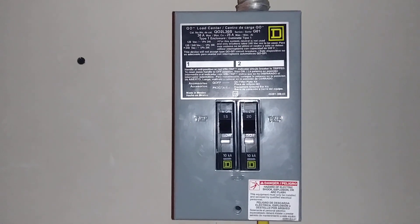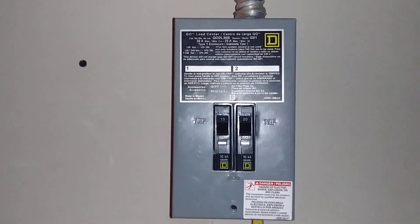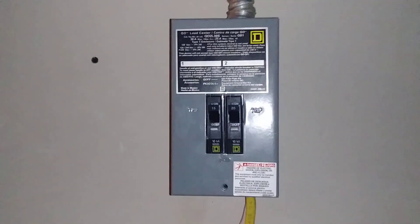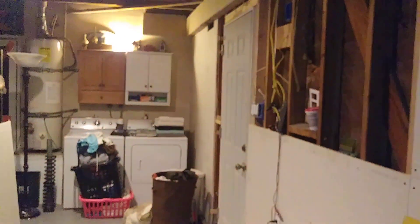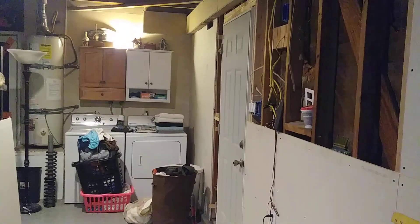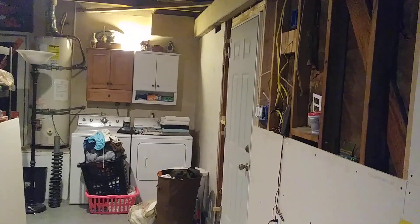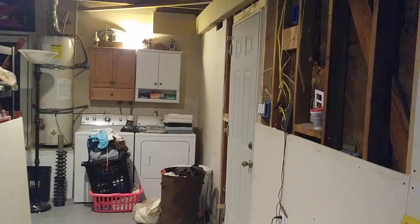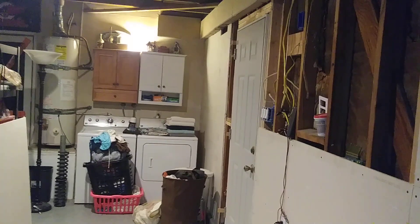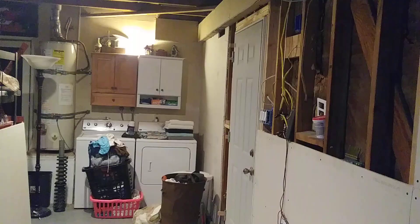It's the first time I've ever done this. I just wanted to show you guys what I did and why I did it. Over in the corner, I used to have an old electrical dryer receptacle on 30 amp wire. However, when I pulled that apart because I was going to put the sub panel over there in the corner, when I took the top off the receptacle, I noticed that there was no ground wire.